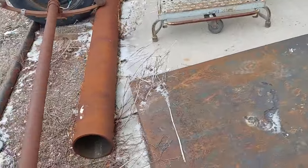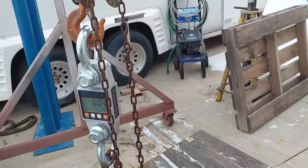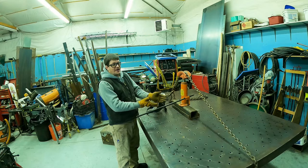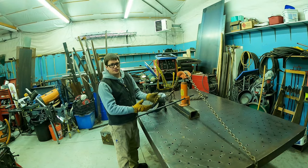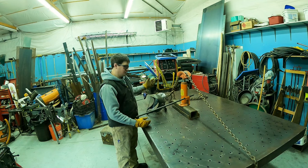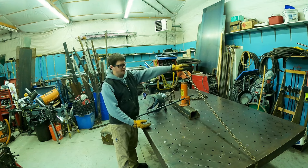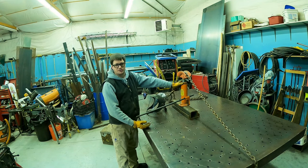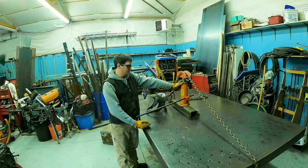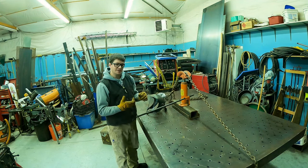The plate's bouncing around off the ground — you can see 604 there. So that is really close. The plate by itself should be like 598, and with all the chain and the hook welded to it, it's just over 600 pounds. The scale reads exactly what the math says it should be. I'm going to crank on this — this is a 12-ton hydraulic bottle jack from Harbor Freight out of their pipe bender kit, so it should be able to put out more force than the chain or hooks can handle.